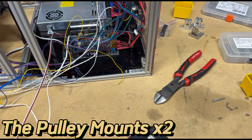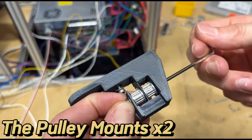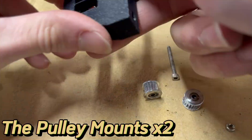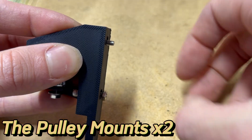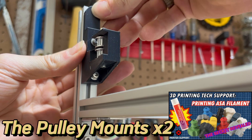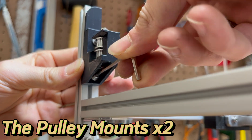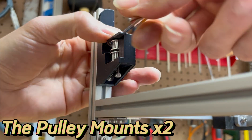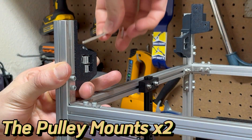We were ready to begin assembling all of the printed parts back onto the printer. There were two sets of pulley mounts that were printed, and these mounts would hold the gears in place. These gears are used for the belts of the Core XY system. This design we had to simplify due to the fact that it was just too complicated. As shown in the last video, we had a layer that needed to be printed upon supports, and every time that this layer was printed it warped, because the ASA did not have enough time to cool and lay down the next layer properly. So this mount would not hold the linear rails, and would instead only house the gears used for the timing belts.